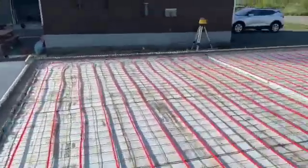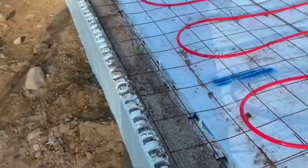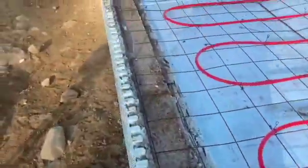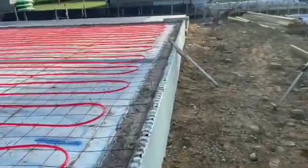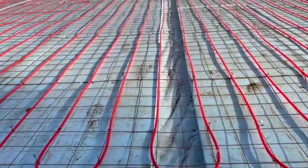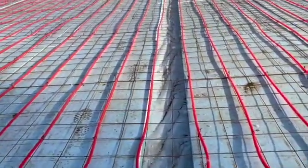That's how we did this detail here. We cut the inside of the block, kept the concrete down low. We're going to pour to the top of here. We stuck our anchor bolts in when we poured it and left them high so they're already in there. When we pour it, it's going to come right up to the top — concrete is four inches thick. We got the thick spot down through here for the load bearing wall — it's going to be about six and a half to seven inches thick there.